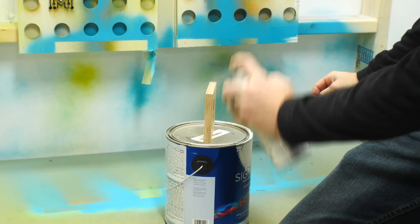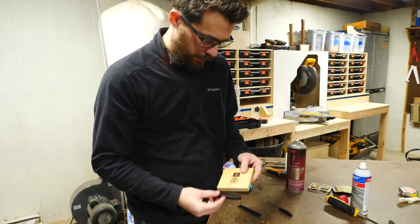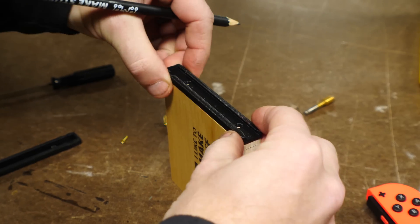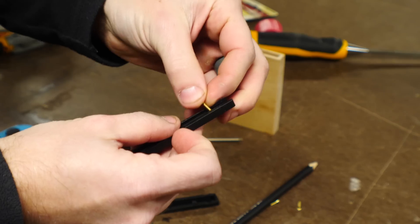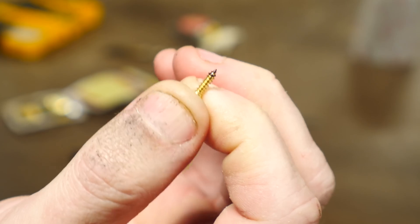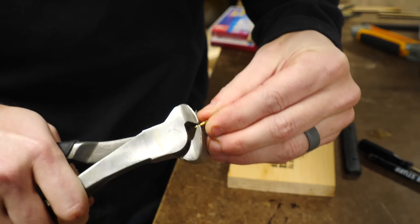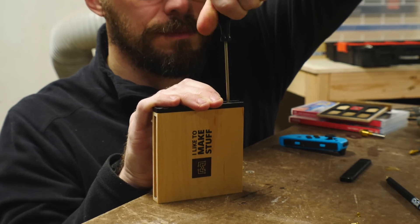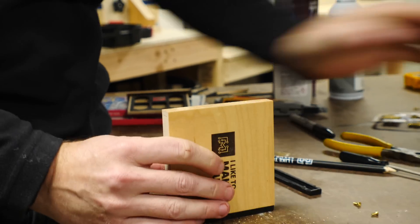The outside faces were pre-finished, but I added some spray lacquer to all the edges that I had sanded. Then I printed out the final rails — I ran out of filament mid-print, but eventually got both rails printed and moved on to adding them to the box. I found the smallest screws I had, but they were still too long, so I laid the rails in place and marked where the holes were going to be, then pre-drilled them to avoid splitting the box. I held the screws in place to mark how long they needed to be, then cut them down with nippers since they were brass. The only thing that really matters is that the screw heads are completely flush with the bottom so they don't scrape up the outside of the controller.